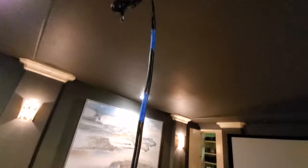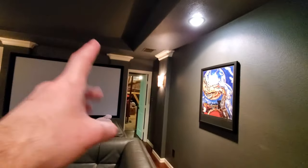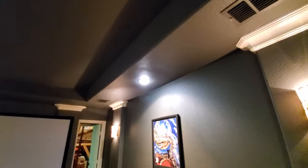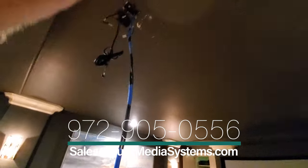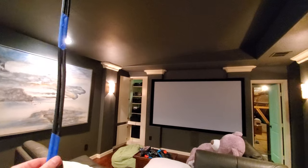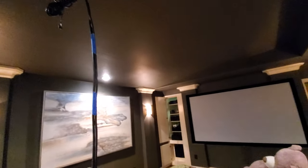We've got the new cable and taped the old HDMI cable to pull it through. Access through the attic had to go all the way around — there was a small portion we could climb up through to get up there. Good thing we found that, because the old cable had been looped up with a service loop at the top and taped with electrical tape, so we had to unknot it from up in the ceiling. The roof line cuts across back above the shelves, making it very difficult, but we do have the cable through now with enough for a service loop on both ends.